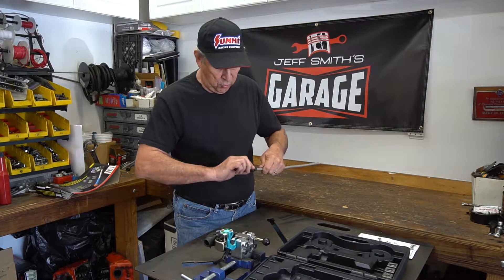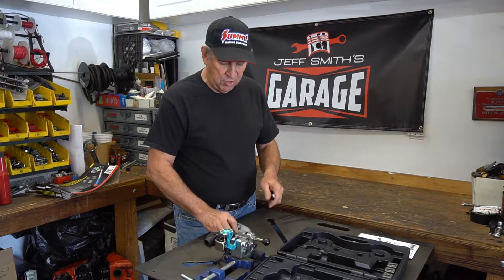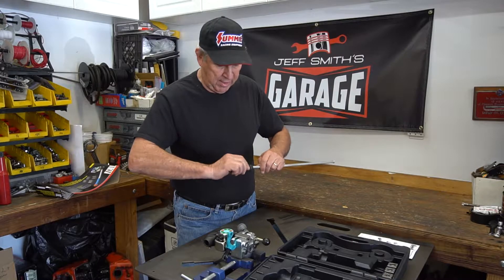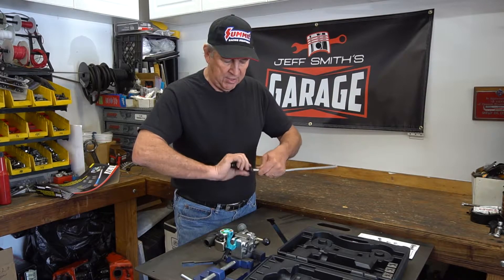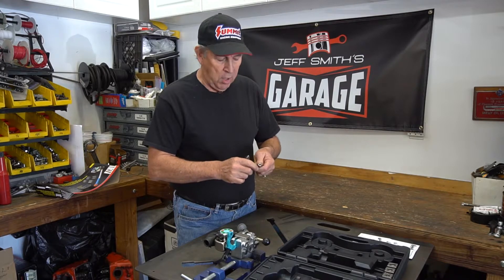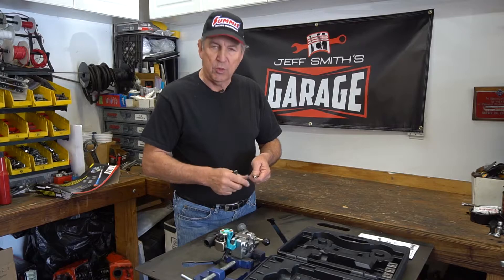So you take your standard deburring tool. This has got multiple edges on it. These tools do have a little deburring tool built in, but on harder tubing it doesn't really work very well. I like a multi-faceted tool like this that'll make a nice clean area, because you want a nice radius on the inside. I actually use a convoluted wheel on a buffing wheel to trim this up and really make it nice and smooth.